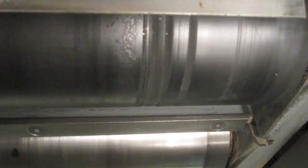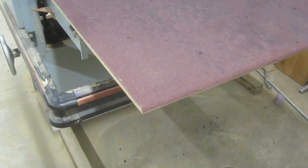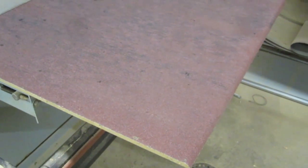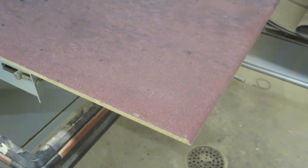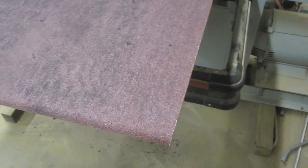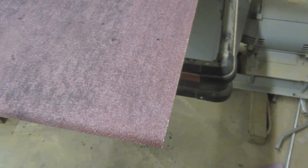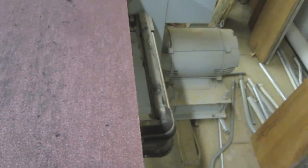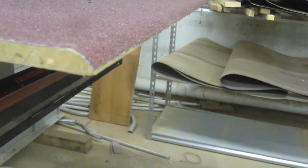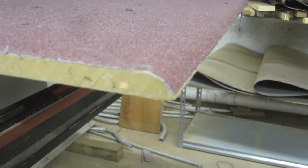So we're going to try that and see how it goes. What I've done is I've taken a sheet of MDF that is 39 inches wide, which is 2 inches wider than my sander. The sander is a 37 inch wide sander — 39 inches wide and about 37 inches long, which is the length or the width of the paper. I've used a spray adhesive to put it onto the MDF after I rounded the corners. The lead edges, front and back, are rounded over so when it feeds into the sander, it will go in nice and not catch anything.